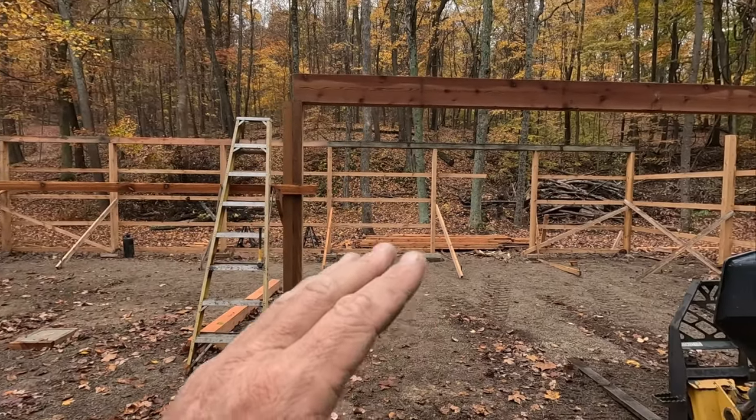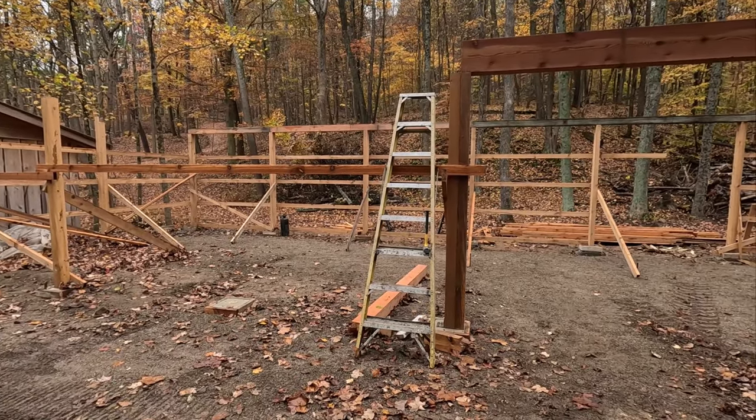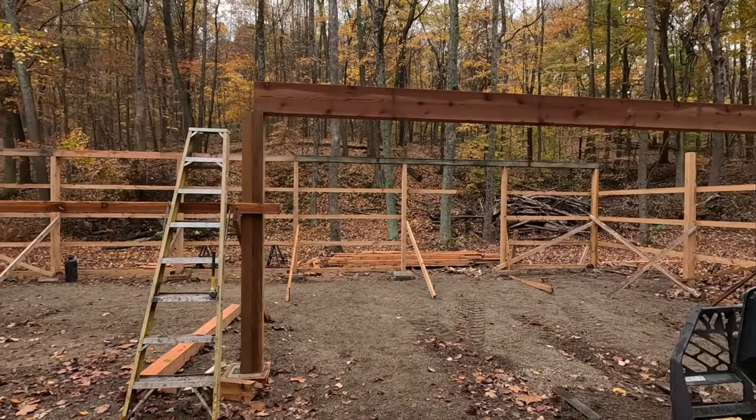So hopefully, like I like to do it, I saw the wood, stack it here, let it dry. I can get the skidder in. The reason I made this 20 foot: on average, 16 foot's the longest thing I cut, which I could have made 18. That's what the original mill shop is, 18 wide. But when you're bringing logs in and taking boards out, they're usually 16 and a half, almost 17. I just wanted a little more wiggle room. And this header, with our angles, I think it's gonna be fine.